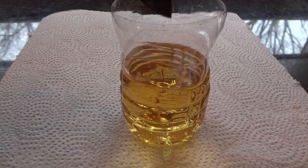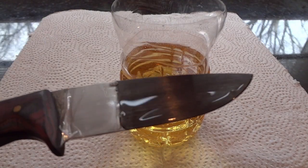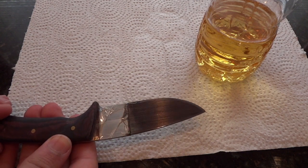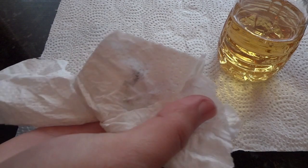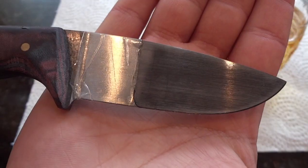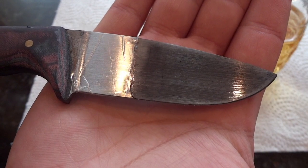Three hours and the knife has a nice patina. After all of my patinas, I put the knife in water. I notice that on some patinas it locks it in and on others it doesn't help much. The water will also slightly neutralize the acidic solution. Apply oil immediately after to prevent the steel from being damaged.